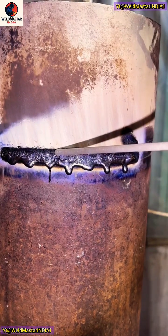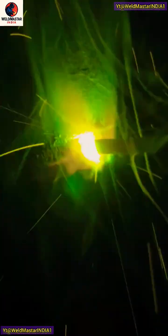For the first pass, use the two-step forward, one-step back technique. Make sure the upper edge line is your center point and press the weld halfway down from that line. That's how you get a full, even, and solid weld bead.